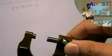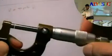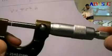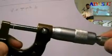First of all, this device divides the millimeter into 100 parts, so it is a very sensitive device. Sometimes during usage it has some errors — zero errors. When I am close to the reading that I want, to avoid zero errors, I have to use this part carefully. Only one click, because this is a very sensitive device and I don't want to apply any extra pressure to the body of measurement.